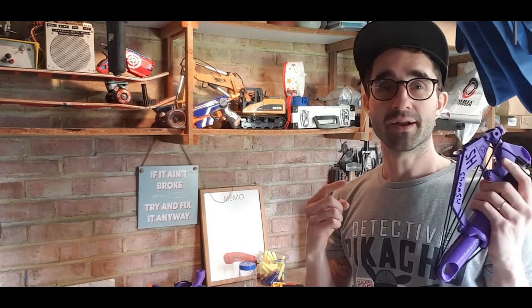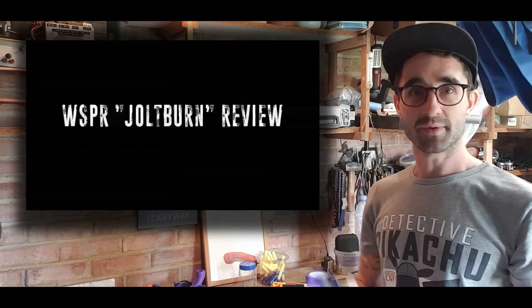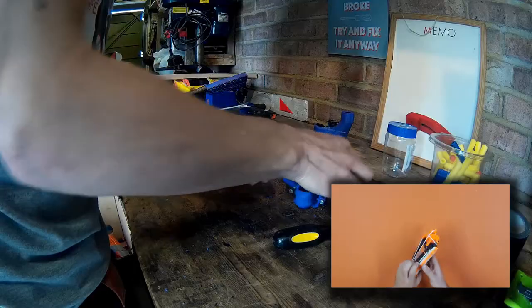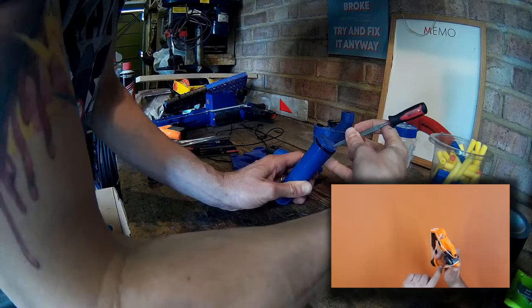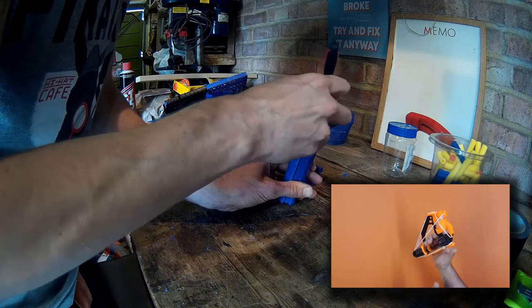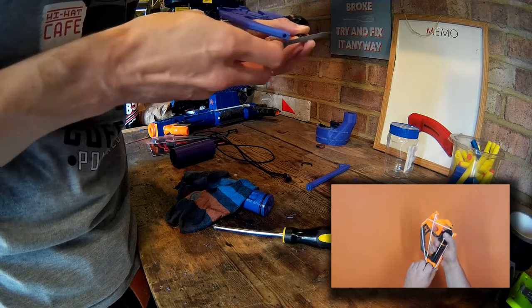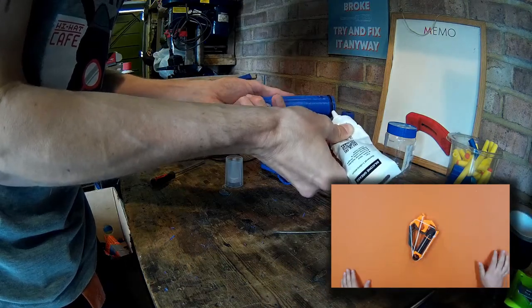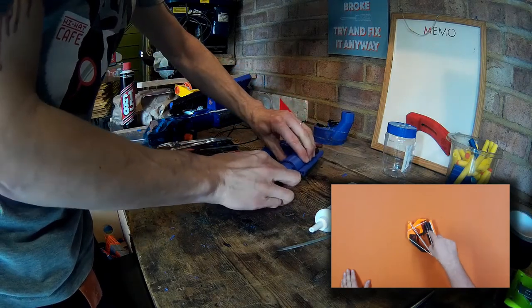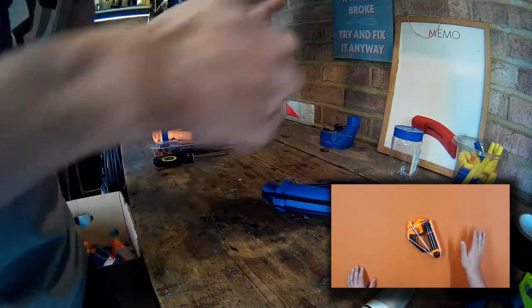I know a man who's already fixed the sticky catch problem — Captain Xavier. I'm going to follow along with his video on how to fix it. I opened it up and filed the area where the catch mechanism rests. There was a little bit of stringy filament from the orange cap, then I smoothed out the top a little bit and added some lubricant, and it hasn't had any problem releasing since. If you're having that catch problem, just open it up, file it down with a file or sandpaper, make sure it's clean, add a little lubricant, and it should be fine.